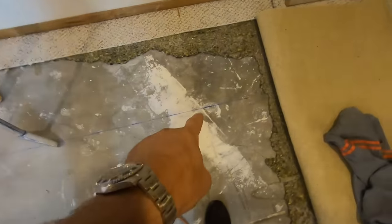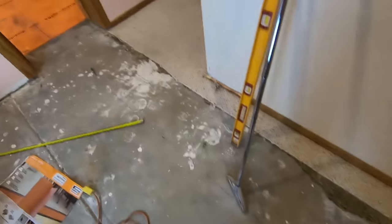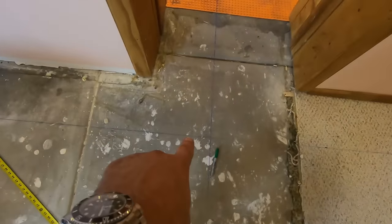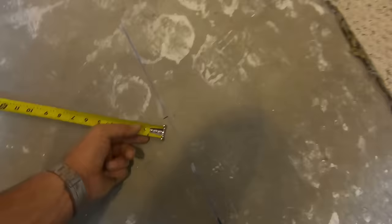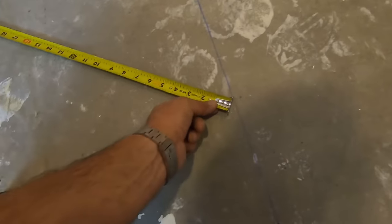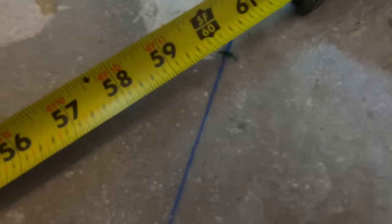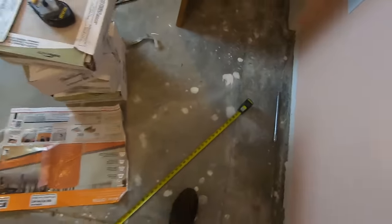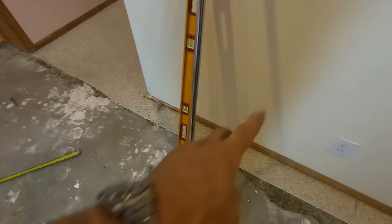There are chalk lines down on the floor. This one here is parallel to this wall by only two points — all the walls are wavy — and this one goes all the way down into the bathroom. I did my 3-4-5 triangle, which most everybody knows about. From the intersection: three feet this way, four feet that way, and the diagonal should be exactly 60 inches — that's the 3-4-5. It's pretty darn close, so this section here is perpendicular to that wall by a good margin.